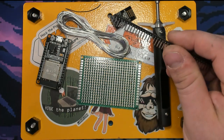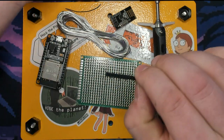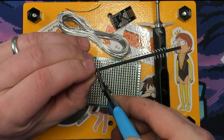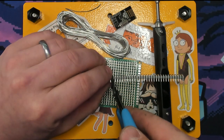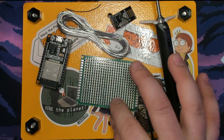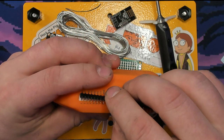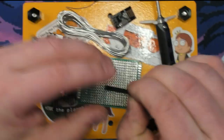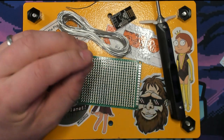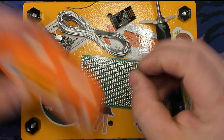The first thing I'm going to do is take our 90-degree headers and measure them up against the pins so we can cut them off. Being very careful not to do this wrong. I've got some flush cutters — definitely makes life a little easier. Chop that right there. And then we're going to make sure this matches our pinout. That's one. Let's go to the other side — it's eight pins. Counting's hard. We got eight pins right there, measure that out, snip. And then make sure this lines up.